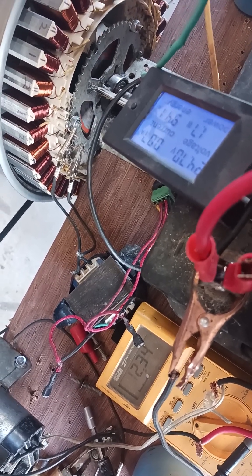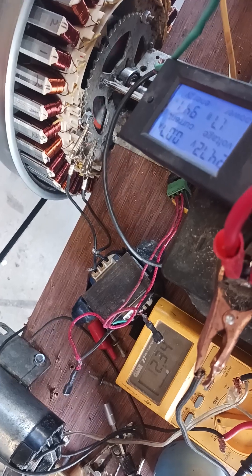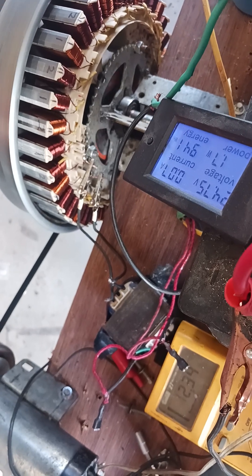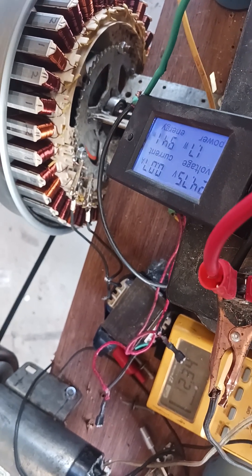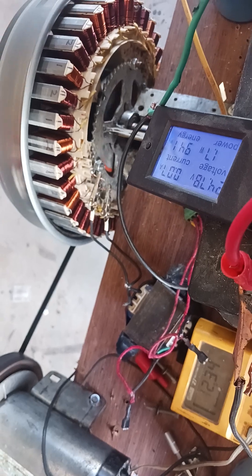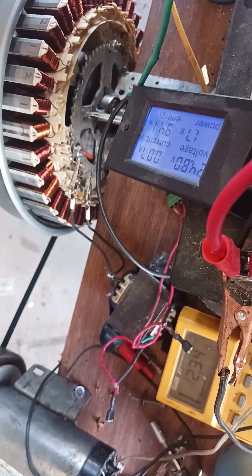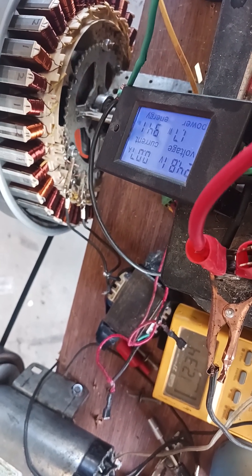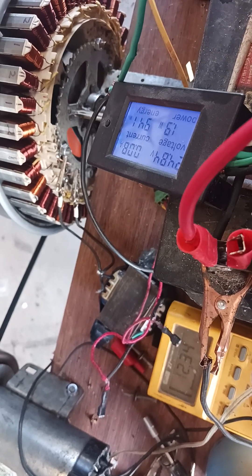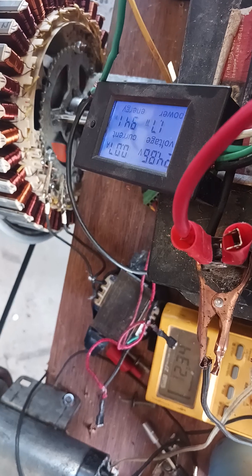I figure a low RPM generator of this sort for somebody living off grid — you let this idle all night long and whatever little bit of power you use on your battery system, this will make up for it. And it can be made to go a little faster to put out a higher voltage, or just go with some different transformers. You may have to wind your own transformers, but it really isn't that difficult. Just gotta think things through a little bit before you jump. So, 0.07 amp — it was putting out 12 amps earlier when I first fired it up because it just had less resistance on it, so that was easier to throw more amps.